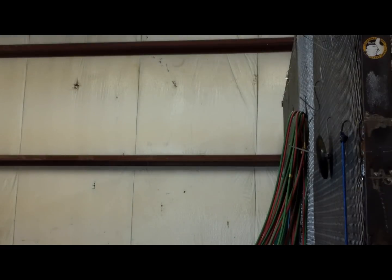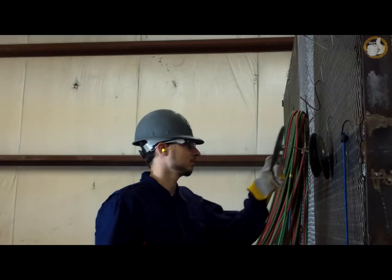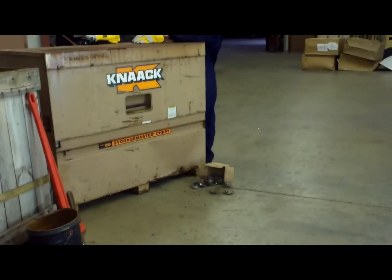Wheels can be stored in the box, flat, or on a hook as long as the wheels have adequate support while awaiting use. If you suspect a wheel or box of wheels has been dropped, do not use those wheels — discard them.